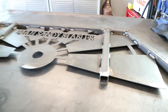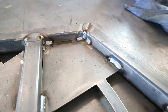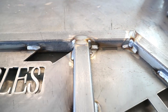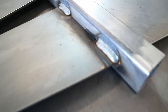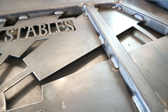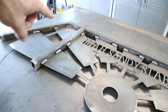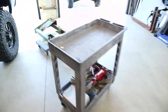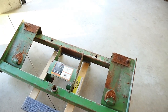I got this thing all final welded and I think it turned out pretty good. I just did a bunch of little stitch welds all the way around. I'm going to go back and grind this section smooth — this section laid really nice and flat. It's quite a relief to be welding mild steel again; it's a whole lot easier than aluminum. The welds are just nice and smooth, not a lot of splatter. I'm going to do a little bit of grinding on the corners, and then I'm going to start working on the mount itself — grinding all this rust off, getting it cleaned up and ready for a new paint job. I'm going to cut this bent plate off right here since I don't see a use for it.